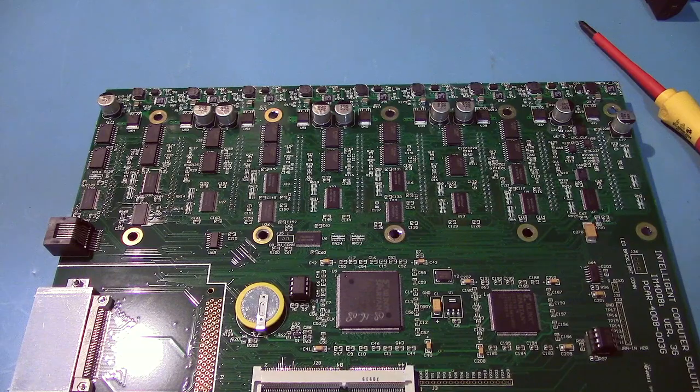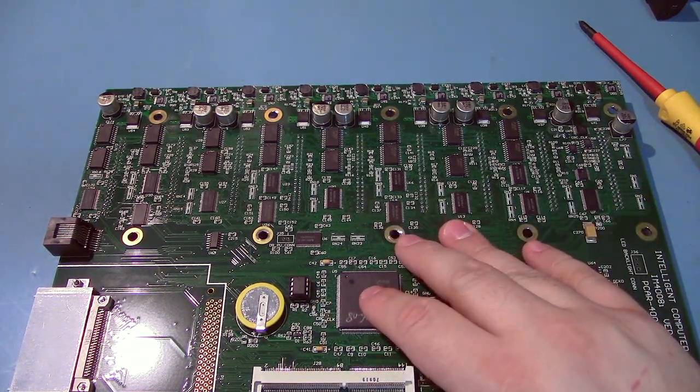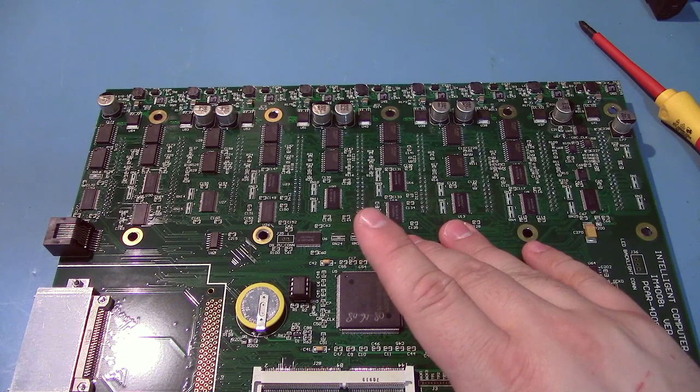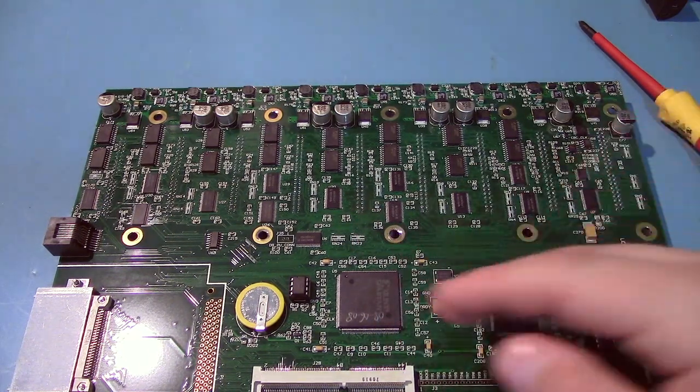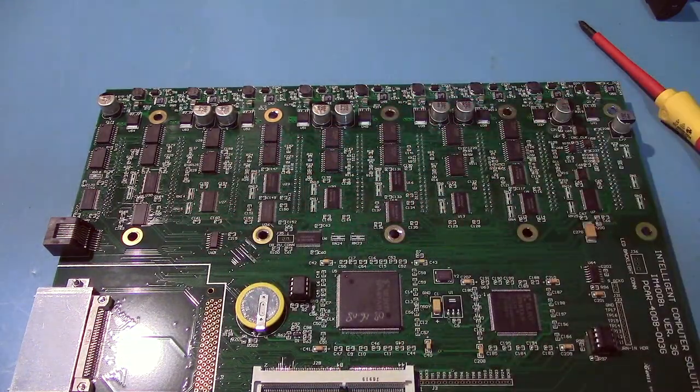And since this thing's designed to do cloning too, the FPGA I think helps them reconfigure itself depending on what they need to do. So I guess it's the more complex solution, but it's probably the better solution, especially if you can upgrade the FPGA to support new parallel ATA interface modes, whereas the controllers probably couldn't do that as effectively.